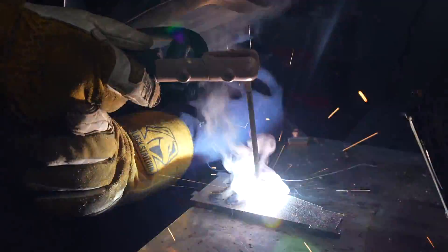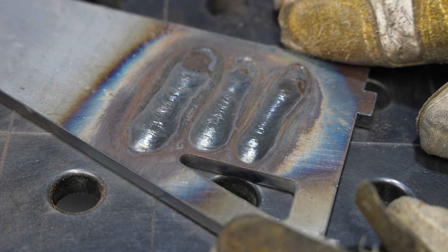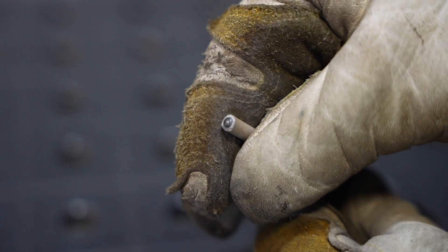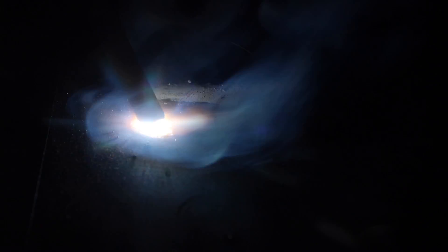I ran three examples — just flicking out and breaking the flux off like before — and you can see at the beginning of all three restarted rods, I have no visible porosity at the start. So next time you're running some 7018, whip out quickly to flick that slag off the end, crunch the flux with your glove to expose a little bit of metal, then when you restart, start up ahead a little bit to allow that metal to burn back and get established with the flux activated at the start of your weld. You should be able to avoid a lot of these issues.